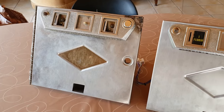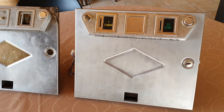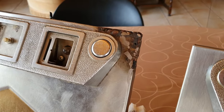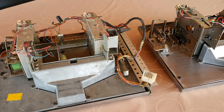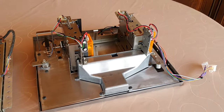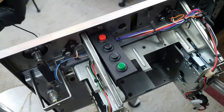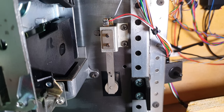Now it's time for the ultimate comparison — the best parts of two coin doors combined and fully restored against the worst parts. The difference is amazing; it almost looks like the restored coin door is new and fresh from the factory. All the front parts look nice and shiny, and especially the badly damaged corner is now looking incredible. Not only the front looks great — I went ahead and made a new wiring harness to make the back of the coin door look like new as well. I wired up 12V for the electronic coin acceptors, power for some LEDs behind the plastic price plates, the old start button as a shift button, a bank of 4 extra buttons for ROM settings, and even the slam tilt switch.